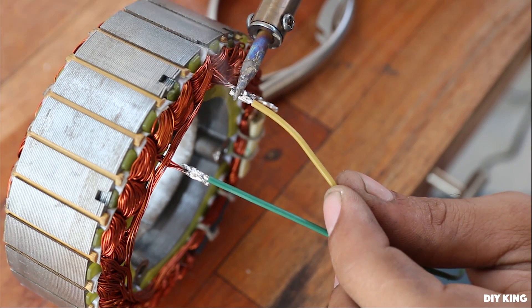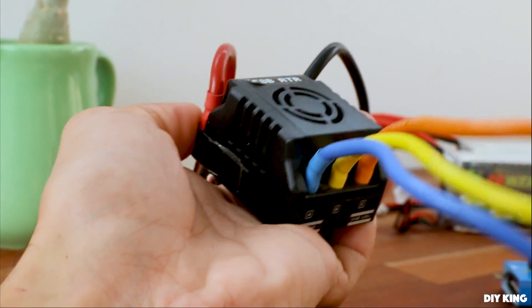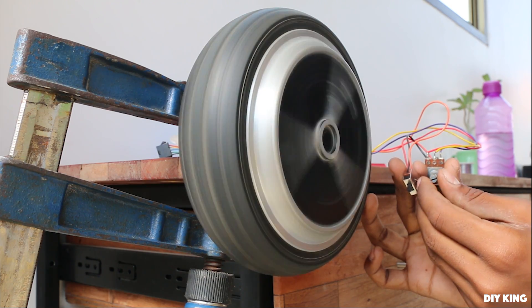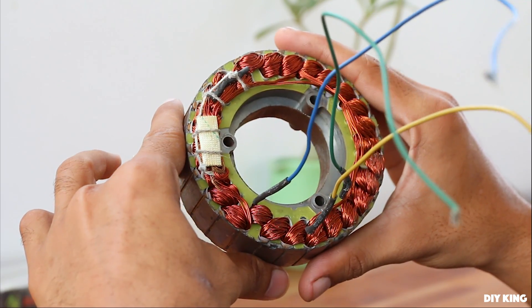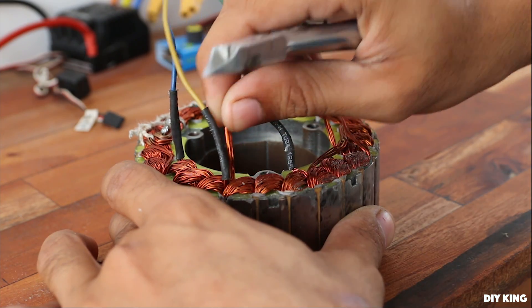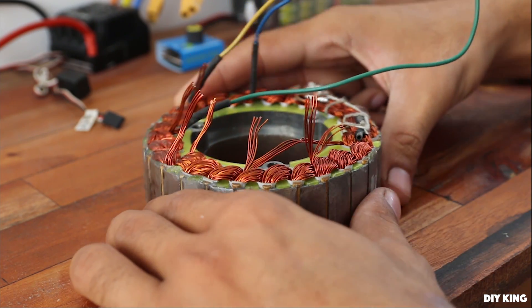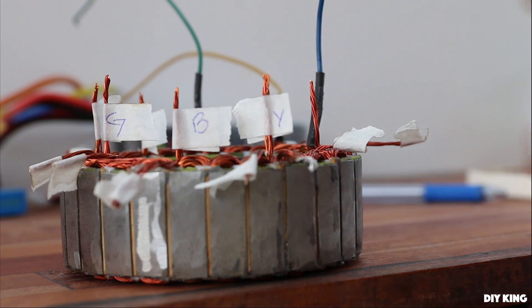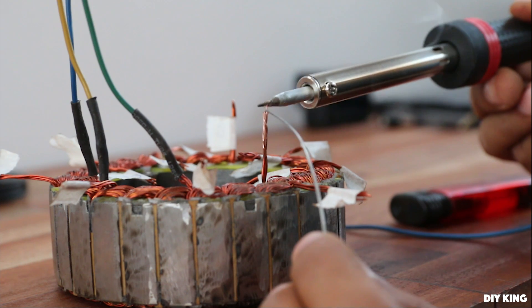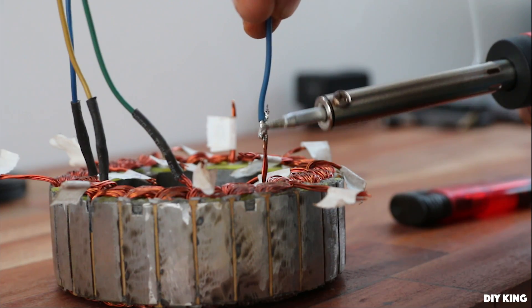We started soldering the wires to the motor. To drive the motor, we are going to use an RC car speed controller rated at 150 amps and 6S, whereas the motor is designed for a 10-cell configuration. To achieve a moderate speed, we are going to rewire the whole stator. This is a three-phase brushless motor — each phase runs across three sets and each set contains three poles. With this configuration, it takes current more time to travel across all three sets as they are connected in series. So what we have done is to connect all three sets in parallel, allowing the current to complete each cycle within a shorter duration, thus increasing the speed of the motor by three times the original speed.